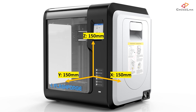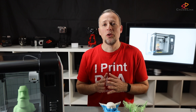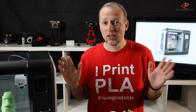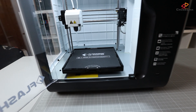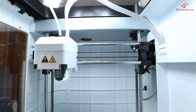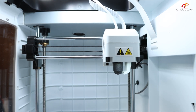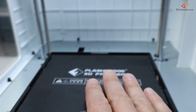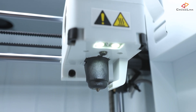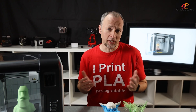Let's run through the most important tech specs. It's got a 150x150x150mm print volume, which makes it perfect for most prints that most users will do, although it's limiting for bigger things. The bed moves in the Y-direction and the print head moves up and down and in the X-direction, like the Ender 3 or Anet A8. The build platform heats up to 100 degrees Celsius, so printing ABS should not be an issue. The extruder can reach up to 240 degrees Celsius maximum, which is average — printing anything requiring higher values like nylon seems out of reach.